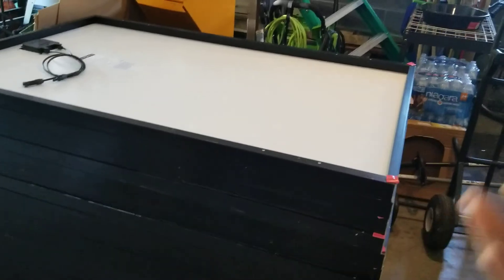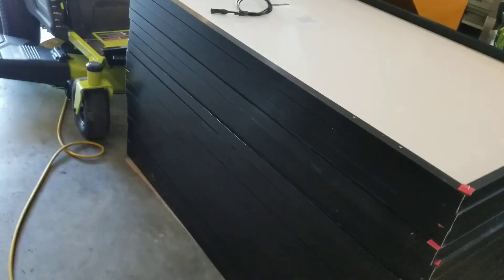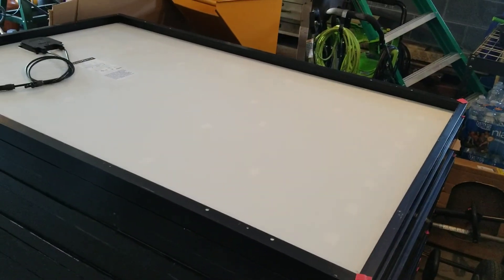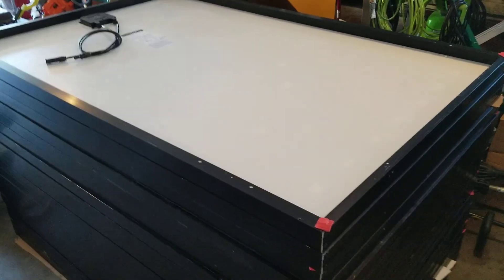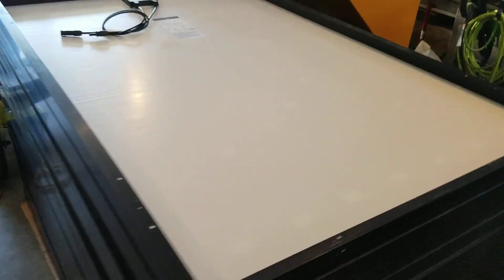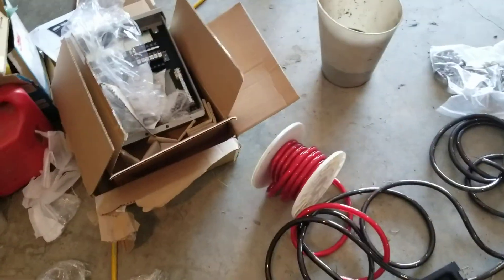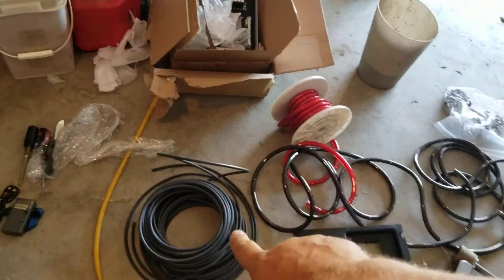A lot of you are wondering how much I have in the total system for charging. About $4,000-ish is probably where I'll be after it's done — I think it's $3,700 right now, but $4,000-ish. So that's $4,000 for 6,500 watts of used equipment and new stuff. We've got some PV wire here — this is number 8 gauge, which has a real high efficiency rating for strings of solar panels.